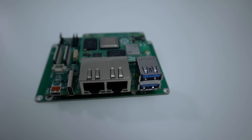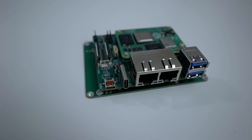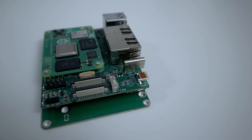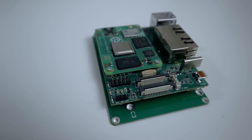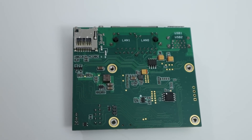Let's talk about the board. You get two USB 3.0 ports and the dual NIC interface — one side for LAN, the other for WAN, though you can configure that. There's a USB-C for power, on-the-go, and programming the board, plus a micro HDMI so you can still access the board if needed. On the other side there's a 4-pin fan connector, two CSI connectors, and an input/output ribbon connector. There are also 3-pin boot pins and additional USB pins. If you have the Wi-Fi version there's a spot for an antenna. There's also a micro SD card slot, so if you don't have eMMC you can still use SD card.